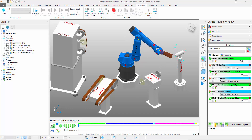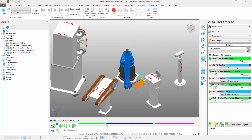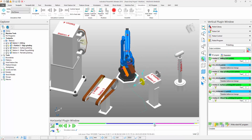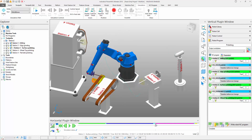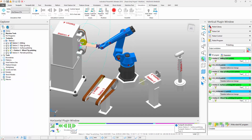Let's start by running a simulation. You'll notice station number one, we perform the milling operation — in this case to machine away excess weld subsequent to the repair operation. And if I speed up the following simulations, you'll notice we get to the edge grinding station, station number two, followed by a small repositioning or transitioning move through to the profile polishing station, and then finally we have the tip grinding station.